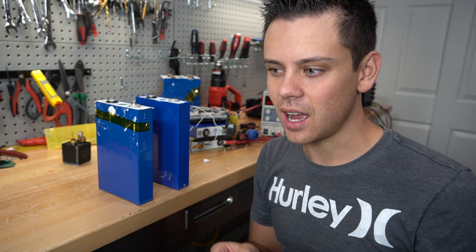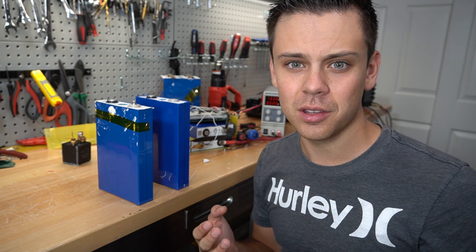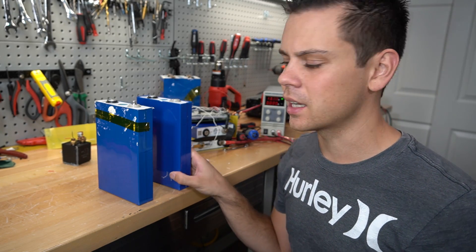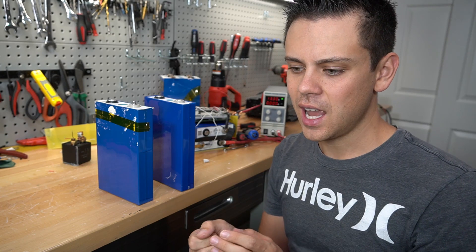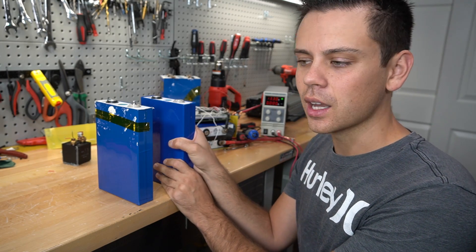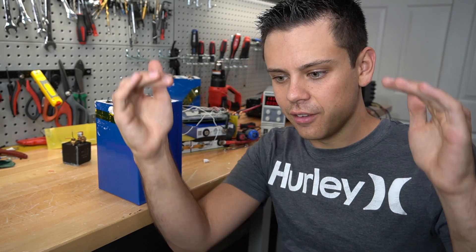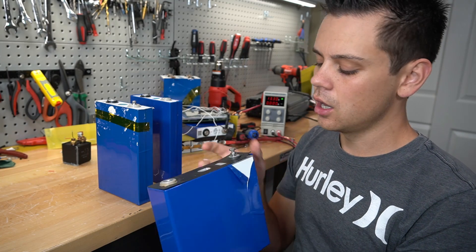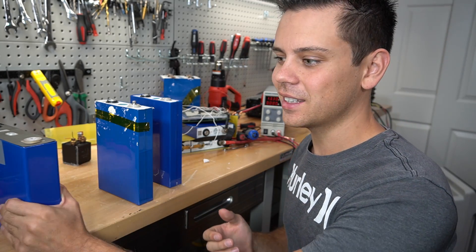I want people to understand that when I do a test, I know what I'm talking about. I have the proper temperature, the proper cycling bandwidth thresholds, I understand the chemistry and how the voltage settles. I've read almost every paper on lithium iron phosphate — I downloaded and read every study I could before starting these videos. When I charge these up, I ensure I hit high voltage disconnect and then lower the current to trickle charge that last bit. That's why I got 106 amp hours — these cells were top balanced, same voltage, and cycled down together. If one hits too low, I catch it instantly, as shown in my video on a grade B 120 amp hour aluminum case cell.